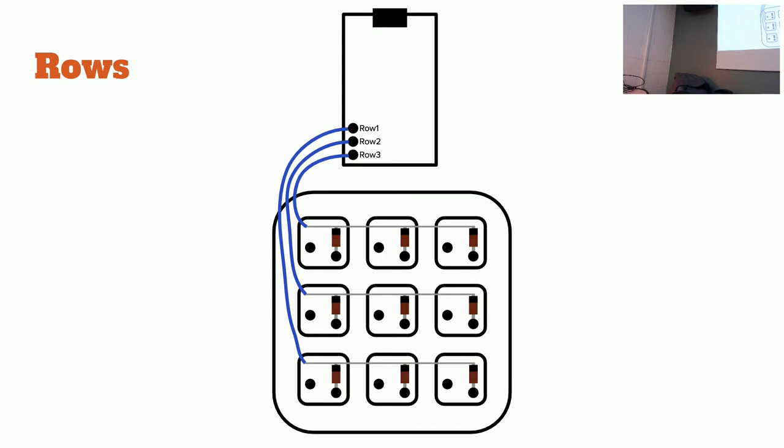Do I want more room on my, where I am? No. Strip the wire? No, you're good. So just a little hook like that, pull it right there, and that will give you at least a little bit of pull. Okay. If you wanted to, you could even wrap that underneath and then just solder it there. Or, okay, if you really want to help yourself, take this and crimp it down a little.